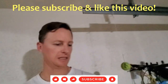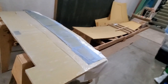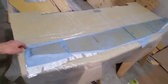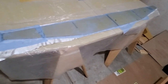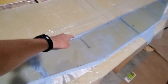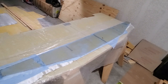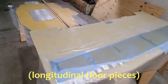I just did like two hours of epoxy work. Let me show you — I got C6 over here, which is the frame just forward of the transom. I'm actually using the transom as a work table with a piece of plastic on it because the shape fits perfectly. Here's C6 with some peel ply on it, and it's got these 10 centimeter slots cut in it — one there and one there — 40 centimeters from the centerline. Some pieces that run from bow to stern are gonna fit into that and hold it upright.